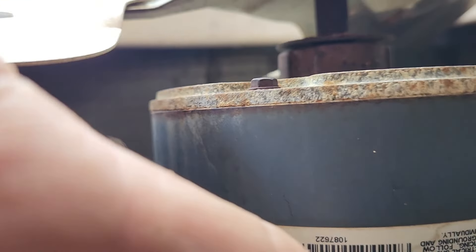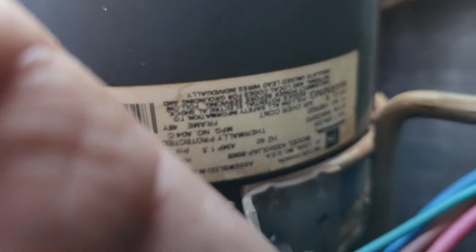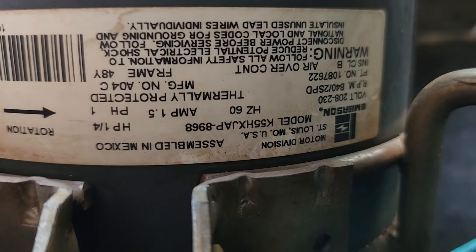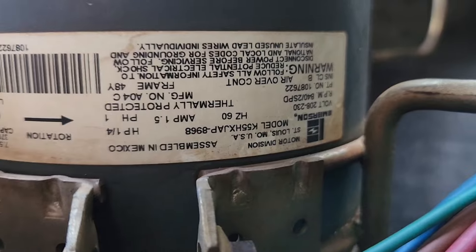You can see this thing's spinning good. I was able to get a picture of this — I can see the rotation arrow right there and it's definitely spinning in the right direction. Up in the top right corner is the micro farads designation. This is upside down, guys. The plate on the fan motor is rotating in the right direction to pull the air out. Up in this right corner is the micro farads designation or limit at 7.5.